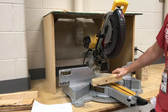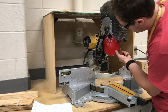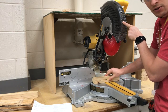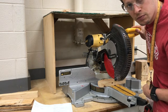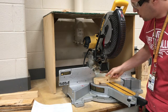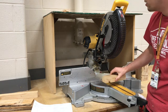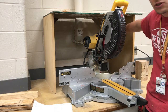Here's an example piece of wood. This is not an acceptable place to put the wood — let me explain why. When the blade spins, it's spinning in this direction. The teeth of the blade are at the bottom and they're pushing your workpiece in that direction. So if the blade comes in contact with the wood while spinning, the piece of wood is going to be slammed back with lots of force. It will make a loud distinctive sound, it won't cut cleanly, and it will probably be jagged and crooked. More than likely that piece of wood will go flying beyond the confines of the table and the fence.